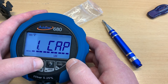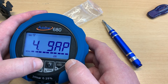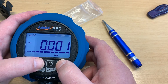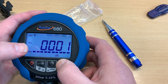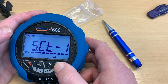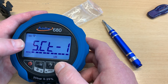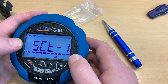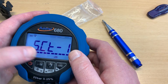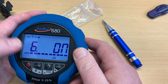In the logging menu, capacity shows how much memory you've used. Ignore send and delete for now. Gap is how often you want the logger to sample — currently it's sampling every one second, which is probably reasonable. Hit escape to exit that menu. Then we have the CT setting: CT1 means logging will occur straight away at power up, and similarly for radio. That's probably a good idea — so let's turn logging on to make sure it's ready to go.